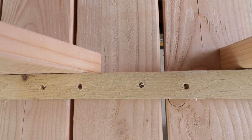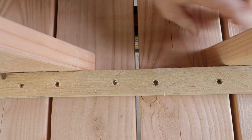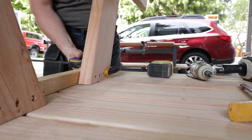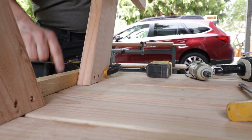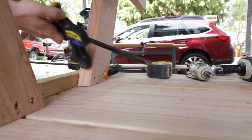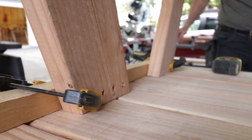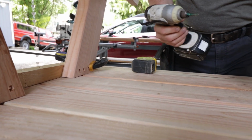So we'll slide that till it meets its mark. We have one on this side as well. It's hard to see. If I scoot it there, you can see it. And there we go. It's good to have a couple of C-clamps. And you want to clamp the set of legs to the brace or the cleat that's holding our table together. If you have two of them, it's all the better. Pinch it together, and now I can walk away from my work and I can complete putting our 2.5 inch fasteners in.